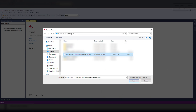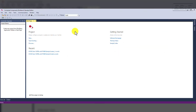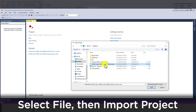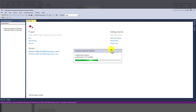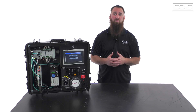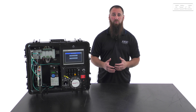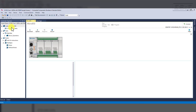Once you have this downloaded, you will see that it is actually a CCW archive project with a file extension of .ccwarc. This project will need to be imported into CCW. Open CCW, then select File > Import Project. When the new window opens, search to the Downloads folder, or wherever you placed the archive file, then select the Open button. This will rebuild a new project file with a Micro 850 along with a 7-inch PanelView 800. Our project matches the same part numbers as the archive file, so no part numbers need to be changed, but now is the time to change them if you have different hardware.